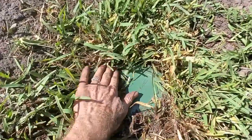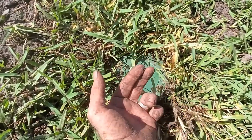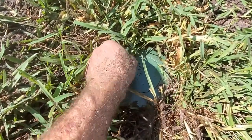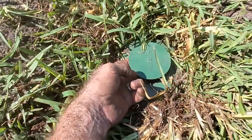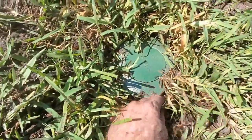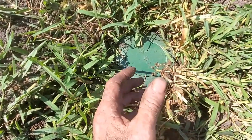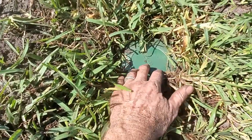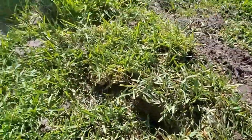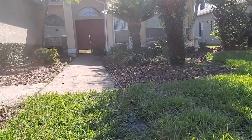You can see I basically just cut the sod around the whole pipe and backfilled underneath of it. It's nice and secure. It already has a slot cut in it in that 90 to let the water drain. So as water comes down the line, it pushes up this pop-up, and the water disperses just right across the yard. Really simple. These things are readily available — so much easier to get them at Home Depot or Lowe's or Ace Hardware. They're everywhere and I think they're about 15 bucks. There are other options — I've showed you many other options of how you can do this. This line goes all the way up to that downspout through all of the bushes and through the sprinklers.